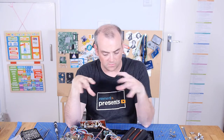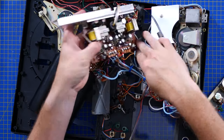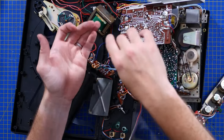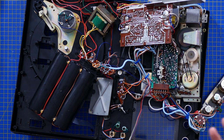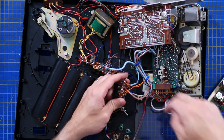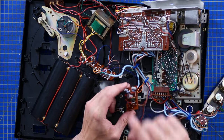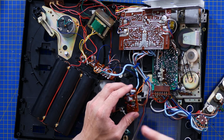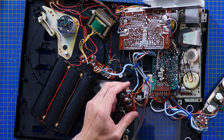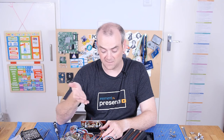I've spent a little bit of time poking around just trying to understand exactly what some of these ancillary PCBs actually do. This big board with the heatsink is clearly the amplifier — a stereo amplifier where each channel is separately amplified — providing outputs for the speakers, albeit very poor at 12W total consumption. I was a little bit confused by this daughter board here, but the giveaway is this light blue lead which runs down to the microphone inputs. So this is a microphone preamp — microphones can give really low level inputs and need preamplification to get them to the same level as the tape deck, the radio, and that kind of stuff, so they can feed into the tape deck for recording at the same level as the radio would.